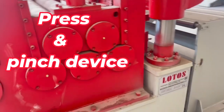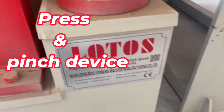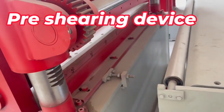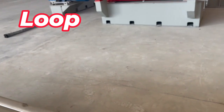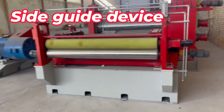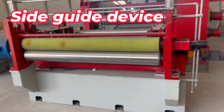This is the five-roller leveling unit after the decoiler. This leveling can level and straighten the material. Here you can see the nameplate. After that we have one pair of shearing here. Then we go to one table — the first loop will be installed here in the customer's workshop. Then we go to the feeding guide for slitting.